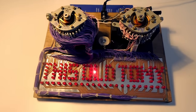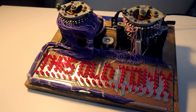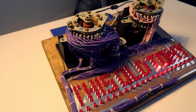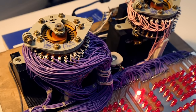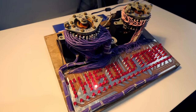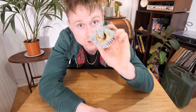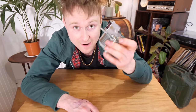What that light chaser did is it basically made use of the interrupt switch on the back of the Uniselector. What the interrupter does is it initiates the Uniselector and then it turns itself off again. This means it goes and it actually spins around in a circle. Look at that. Oh, you can see it slowly circling around. And you can see in the light chaser how we used that to automate the lights to make it look like it was going around doing a nice animation. If you aren't fully aware of what a Uniselector is, I'd definitely recommend you go and watch that video first. The link is below. And hopefully it'll make it a little bit more obvious about what we're about to do today.